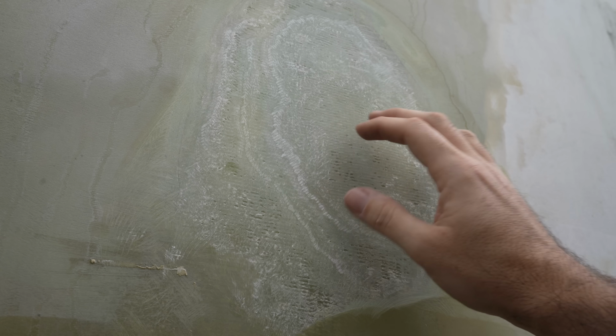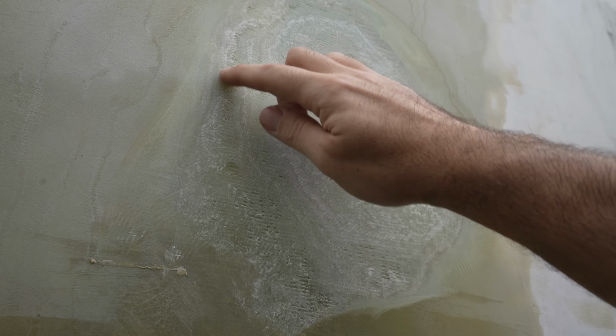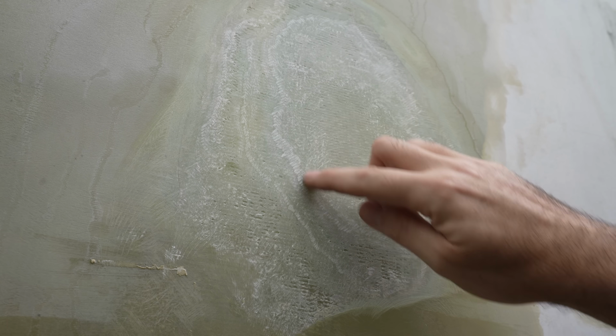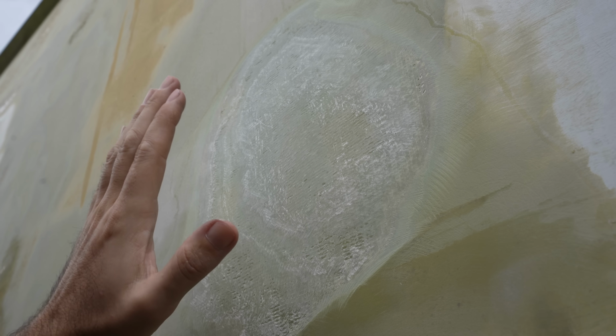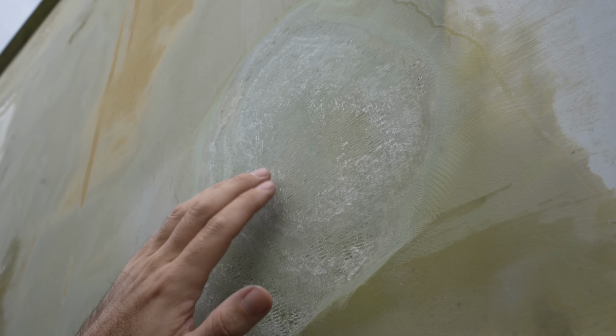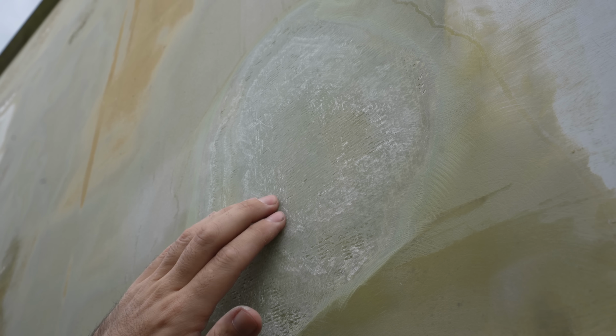As you can see here, I've ground down through the layers of the fiberglass that makes up the laminate. There's a layer here, here, and here. The shiny spots up here and here are embedded inside of the laminate. It's areas where the laminate wasn't thoroughly consolidated, and that's really bad news because that significantly weakens the strength of the laminate.